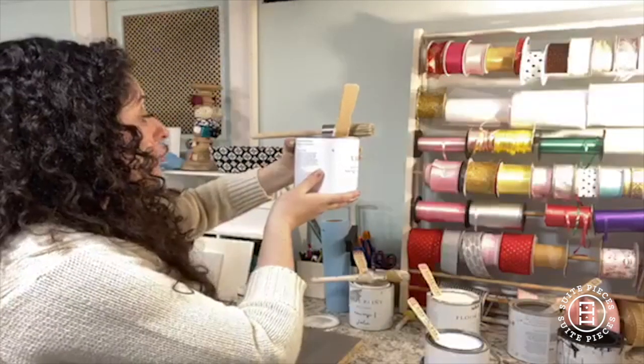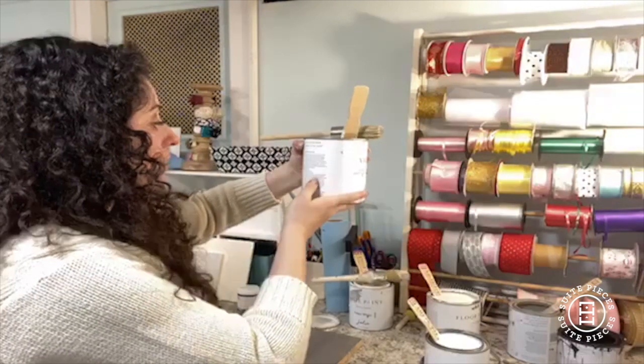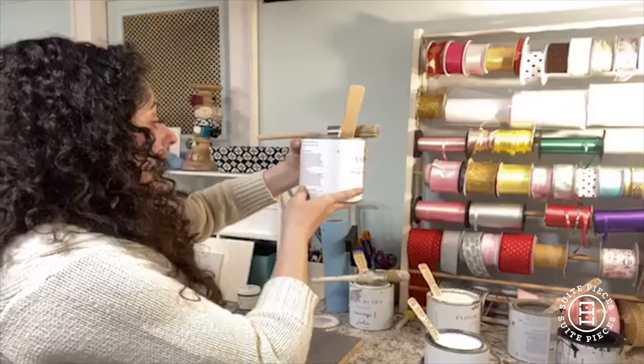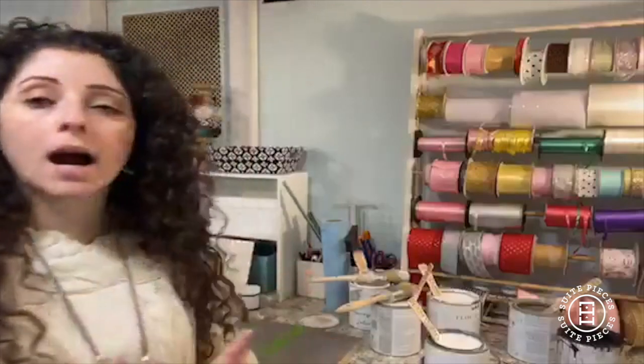Okay, you can also use a sprayer with the Joli varnish. And it doesn't actually say that you need to cross hatch it. So I think that's more so for floors, because the piece is being walked on, that you want to do that cross hatching. But I think on furniture, it's totally fine to just go in the same direction.